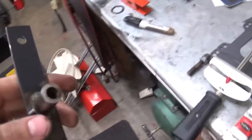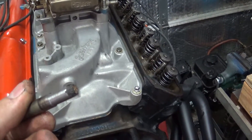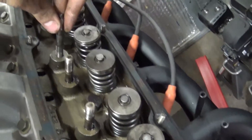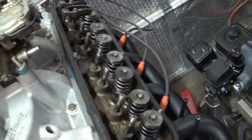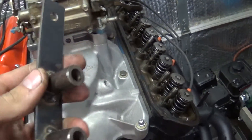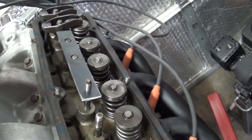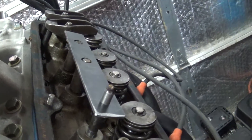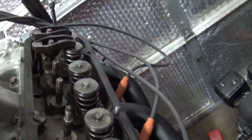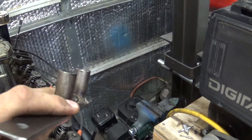To make this, I took the stud that I pulled out of here and I turned the end down on the lathe to the size of the shank of the tap. Since this is 3/8, it fit right into the hole that was already in there from when I pulled it out. Then I made these little sleeves here on the lathe — just some 5/8 round bar that I cut and then drilled 3/8 holes into. I put those two down over these studs, set the plate on top of it, tacked it, pulled it off, fully welded it, and then had to beat on it with a hammer a little bit to get it perfectly straight because the welding made these pull a little bit.